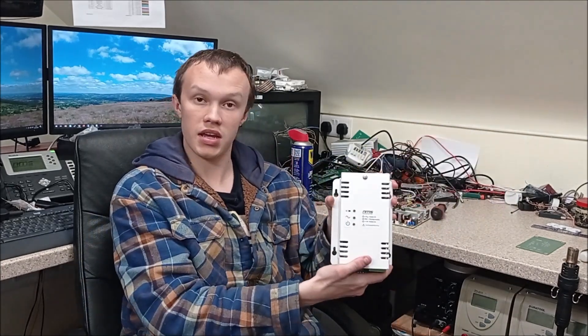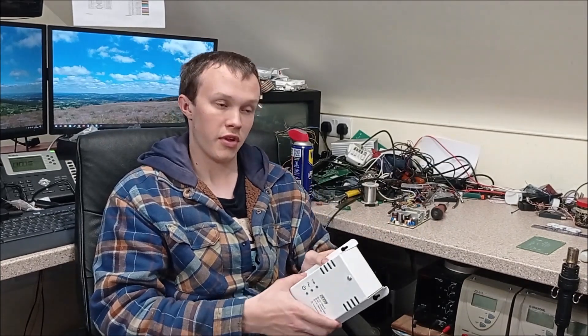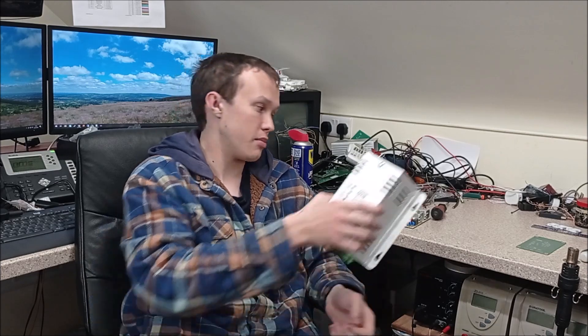To combat this I have created a dedicated 12 volt UPS. The idea of this unit is that I can connect up a 12 volt battery and it will power everything from mains normally. But whenever we lose power it runs from the battery and keeps the battery charged up. I've also given it a monitoring port so that if I'm away I can see that we've lost power.